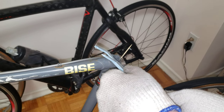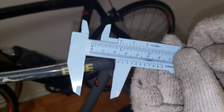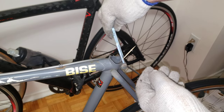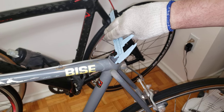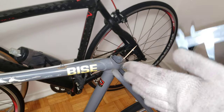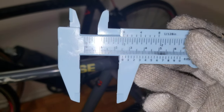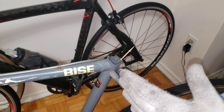So I'm going to open the caliper and measure this — make sure it's seated all the way. We'll measure a couple of times. What do we have? It's showing 25 millimeters. I have the toothpick there so the clamp is nice and open all the way. Now coming at it from a different side — look, 25 again. Going this way — 25 again. Very interesting. So we have properly measured: 25 millimeters.